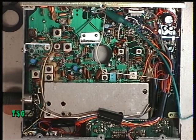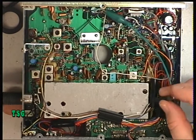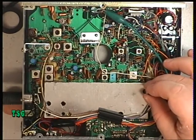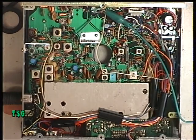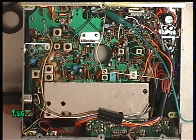So what we'll do now is transmit and go through it with you. This particular area is like new, and I'm just going to put it on frequency with the 36.6162 oscillator which should be down there. It was marginally out — virtually not worth adjusting. It should be 2779125 or 2779121, which considering this is a 30-year-old set is brilliant.